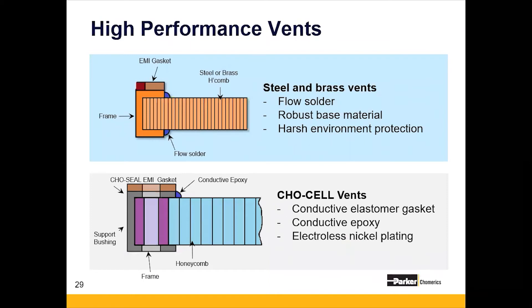There are several advantages to using steel or brass honeycomb in higher-end performance vents. The more obvious reason is strength and durability — the rigid construction prevents damage from minor bumps, as honeycomb is quite fragile and can be damaged easily, potentially eliminating the need for an added support like a kick guard or frame brace. Steel and brass tend to be used in military enclosures and communication shelters, especially when designing for EMP hardening or TEMPEST equipment, and in extreme environments where weather, salt fog, or salt spray is an issue.